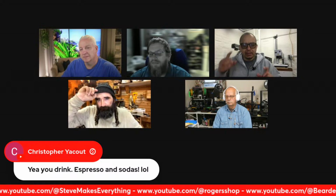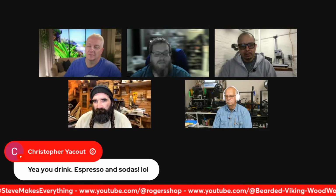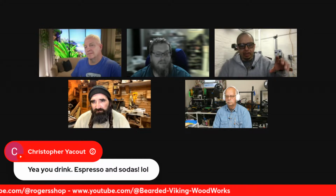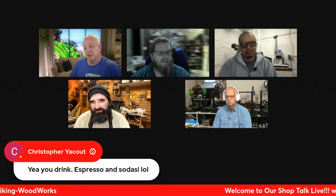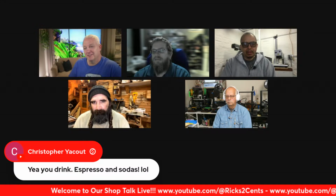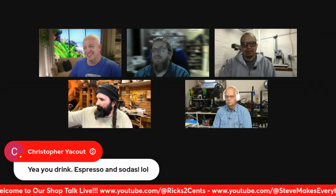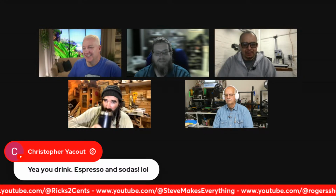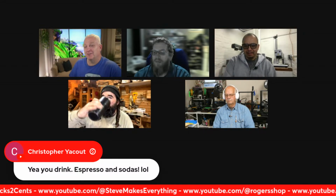But instead of just stopping it, you can pause it, and as long as you don't move it, you can hit resume, right? Gotcha. But if you stop it or you move it, you've got to home. Otherwise, it doesn't know where it's at. I got you. That makes sense. Some newer lasers will automatically recover from a power failure, but they still can't predict what users are going to do. They don't know where you moved it. You pushed it out of your way, especially if you moved it manually.